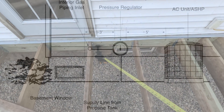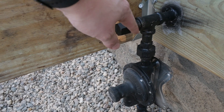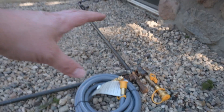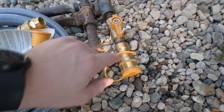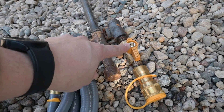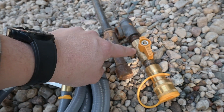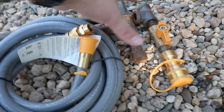Note that putting your regulator underneath a deck like this is not optimal, and it may not even be to code. We're going to start right here by spinning this out of the T, then drop it down below these joists and strap it up to the joist, making sure that we don't have the black iron pipe touching the joist directly. I don't want to rely on these quick connect fittings. Technically they do shut off when you disconnect them, but I always want to have a valve shutoff in addition to that if I'm not using it. So it's worth the investment to buy those valves — links will be in the description to the valve, the kits, and the fittings.